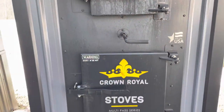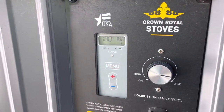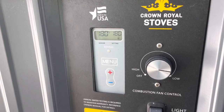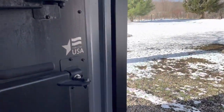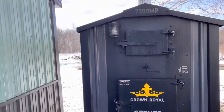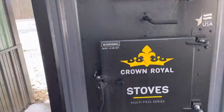I'll pull the back so we can open it up and I'll show you the inside. It just came off cycle, so I've got to give it a little bit for some of the smoke to get out. I run it up to 180 degrees. In the coldest part of the winter, I was keeping about an 8 or 9 degree temperature difference. Now that we have some warmer days, I keep it about 5 degrees — that's the difference before the boiler kicks on. I cracked the door to let some of the smoke come out so I can show you the firebox.